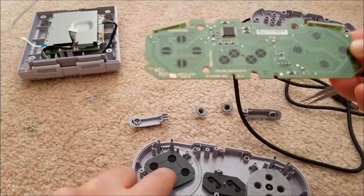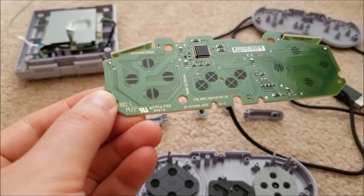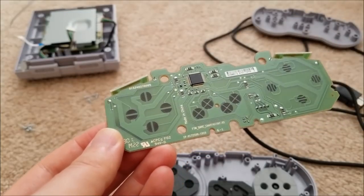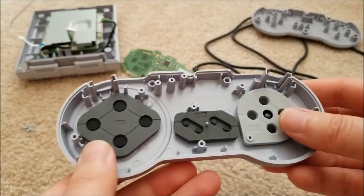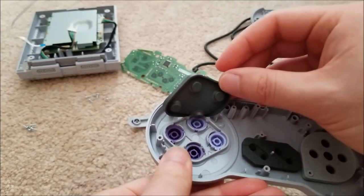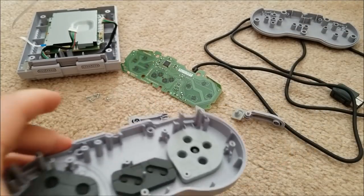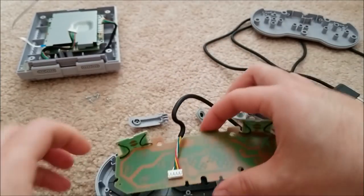You can see carbon conduction on all the button pads as well as on the rubber domes. Interestingly, there are two separate pads for Start and Select. Other than that, we just have some zero-ohm jumper resistors since this is a one-sided board — they use those to help with layout. One cool mod: this is pretty much compatible with the original parts, so I should be able to take out the face buttons and replace them with Super Famicom Japanese-style colored buttons — yellow, blue, red, and green.